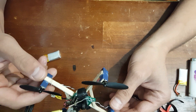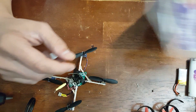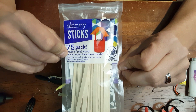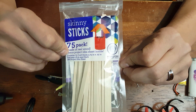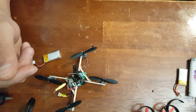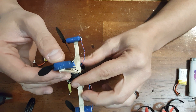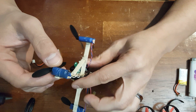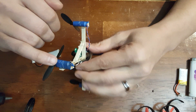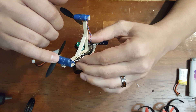It's really light. It's really quiet. For the motors, I used these skinny sticks — I think my wife picked them up at Hobby Lobby or Joann Fabrics or something along those lines. I cut these just a little bit longer than the motors, and then I heat-shrinked the motor to this piece of wood. From there, I hot glued the heat-shrinked motor to the wooden frame, and then I wrapped it with fishing line.